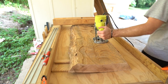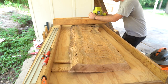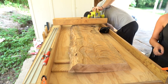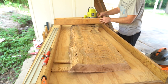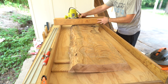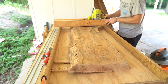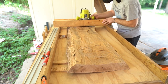Now it's time to flatten this piece out the best that we can. My method for doing that is my plunge router that we've been using for several tables over the past year. I had to make a longer setup than usual, and because this piece is a little bowed, I'm starting with the bow side down and using some shims on the one side to balance it out as I take my very first pass with the router to flatten it. This is going to be a very tedious process.